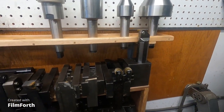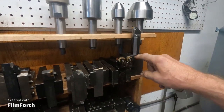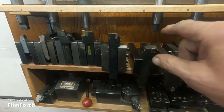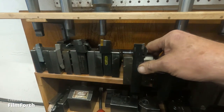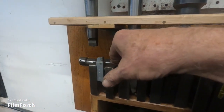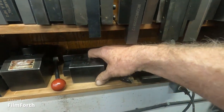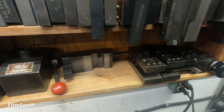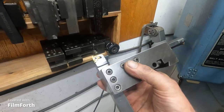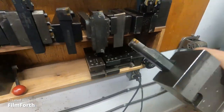I'll do a quick look at the tools I'll be using on that Axelson soon. I've got an internal grooving tool, a bump knurler, a high-speed cutoff, a carbide cutoff, a CNMG, a grooving ISCAR, and some profiling tools — DNMG left-hand and right-hand, good old high-speed, and a Micro-100 finishing tool. Then more odds and ends around the corner. This is what they call the threading bar — I've got a couple of lay-down threading insert tool holders there. Internal — you flip it around, see? I'll take it over to the tool post so you can see that.